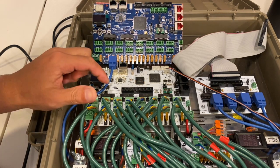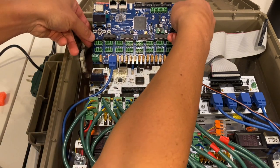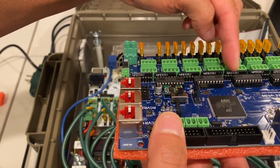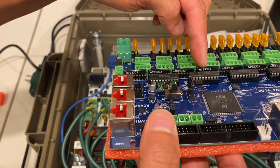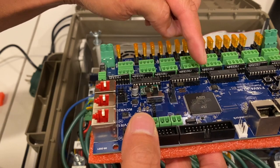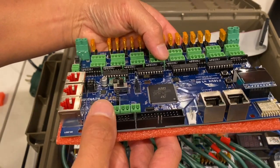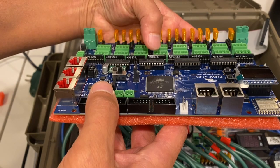One last thing: the V3 comes shipped with resistor banks comprised of 100-ohm output driving resistors. But on the V4 resistor banks, labeled B330J, these are actually 33-ohm resistors — matched to your WS2811 pixels for really good driving distances. This is the same resistance output as in the F amps, so you won't need to put an F amp on the output. You should get really good driving distance on your pixel data runs to your first pixels.